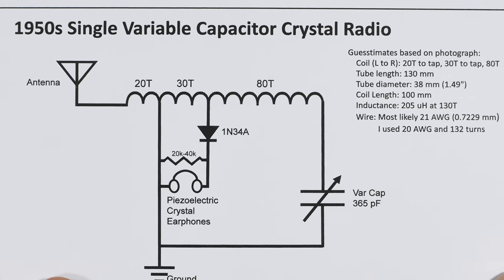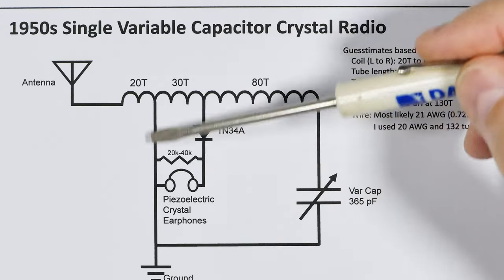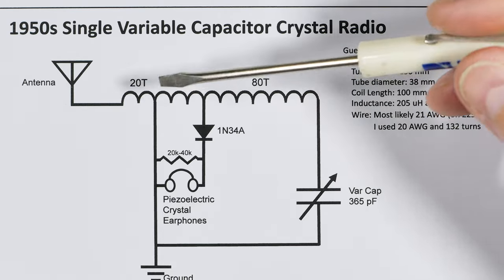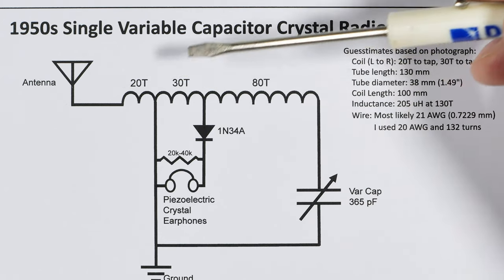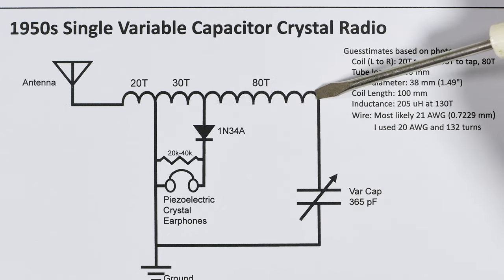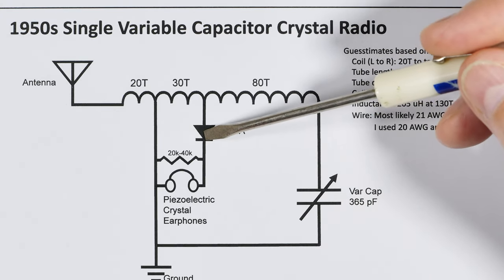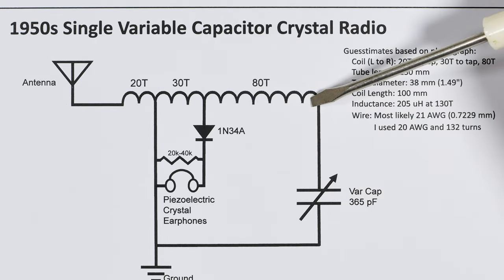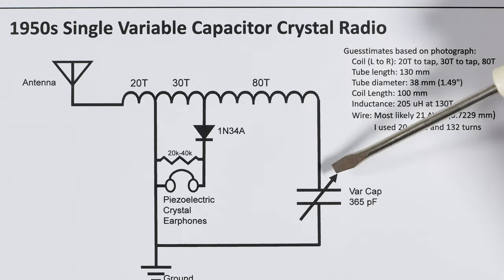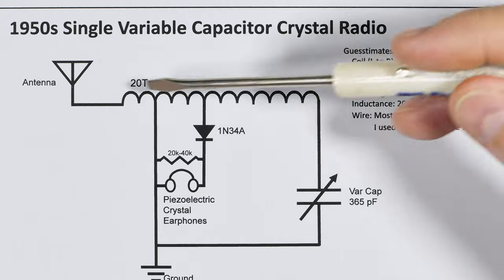The reason I like this design is that it has a circuit for the antenna ground that's tightly coupled to the rest of the tank circuit — the resonant circuit — and that's usually a feature of a better radio. The next thing is that the remainder of the inductor is divided into the headphone circuit with the detector and the variable capacitor part, so the headphone is not robbing power across the whole thing and the antenna is not just blasting through the whole coil either. This has good features of superior-performing radios.